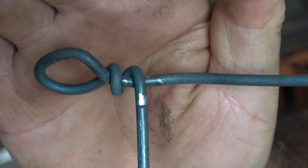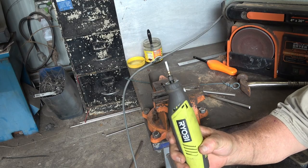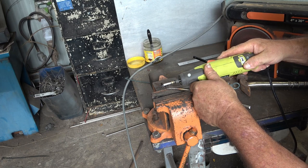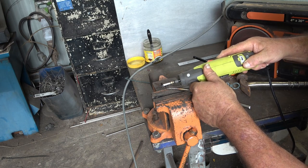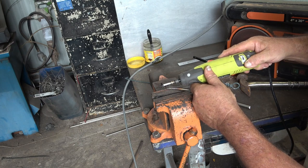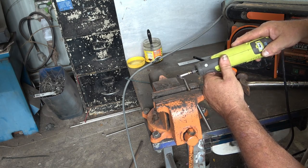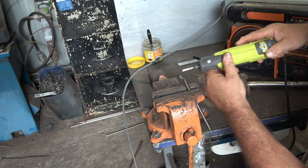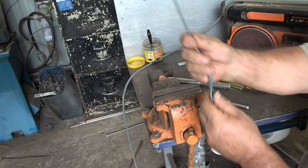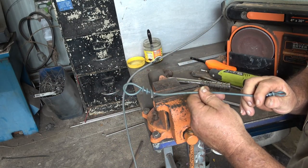You can probably see now more clearly where that chamfer is cutting in here. I've got a four millimeter round grinding stone and that's marking the wire up a lot less now - it's working really good. I'll do that with the other one then we'll move on to something else.